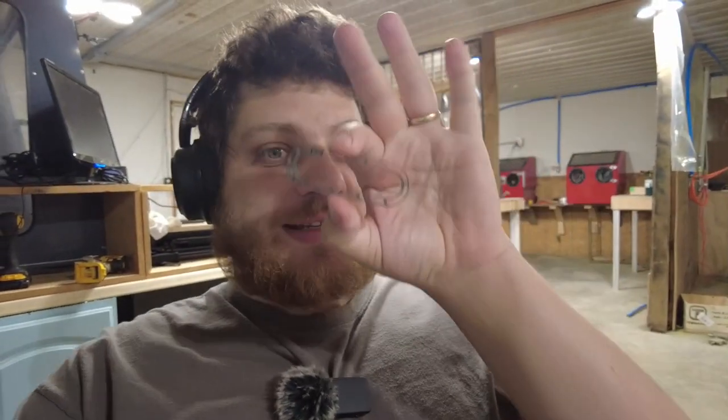I was doing some procrastination, and I finally got an idea on how to fix this. In a nutshell, my issue is that the carabiner is not exactly where the mill thinks it is. I don't know if it's because my fixture is bad, or if my fixturing is bending the part, or if the parts are too far off from what they are in CAD. But I have this little magical thing called a probe. If I split this up into a couple different work coordinate systems, I can just probe those individually, and that'll adjust for any misalignment in my whole setup. So I'm going to go back into CAM, break this up into probably three different work coordinate systems, then probe it all in and see if that fixes my issue.